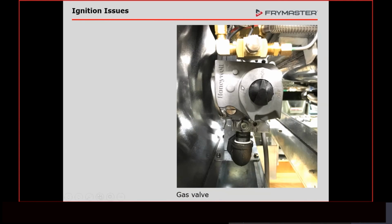All right, this is the gas valve. Our gas valves' maximum pressure is 0.5 psi, okay? With the 2-pound pressure systems that a lot of construction companies have gone to, because you can use smaller pipe if you bump up the pressure, they have to have it double regulated. I don't have all the ins and outs on that. I know just enough that whenever we have an issue, especially on a new install, where we have multiple gas valves with voltage to them but they're not opening, I guarantee you the problem is we have too much pressure.